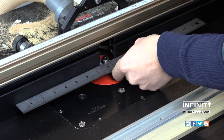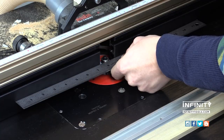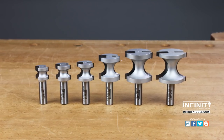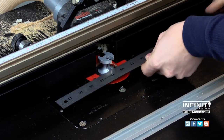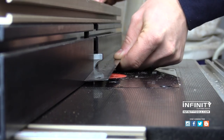If you're using a bearing guided bullnose bit, you can use that top bearing to adjust your fence. If you're using a non-bearing guided bullnose bit, you'll want to use a ruler and reference off the center portion of the profile to create the correct shape on your workpiece.